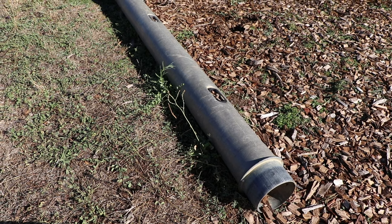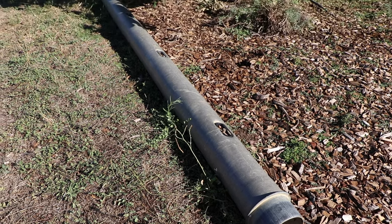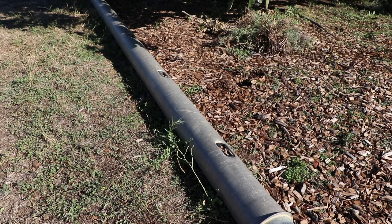The third type of irrigation system we use at the farm is furrow irrigation, using a gated pipe to put water into the furrows. These gated pipes are six inches in diameter and can be 20 or 30 feet long. Every 30 inches along the pipe there's a gate — an opening that lets water out. You can open, close, and adjust the size of the opening for the amount of water you want, with each gate putting out as much as 16 gallons per minute.